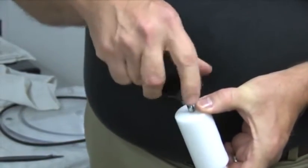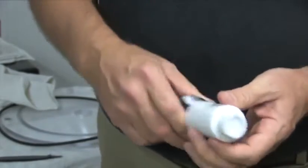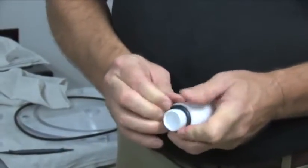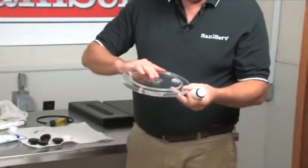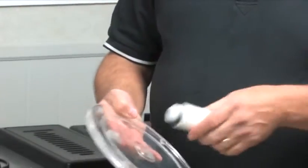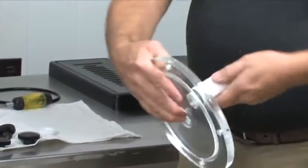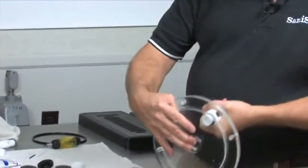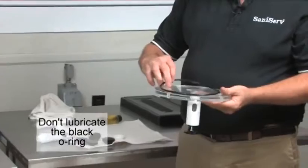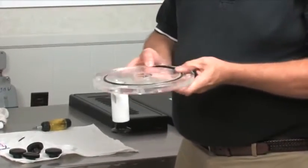We have the knob — it looks different than the other ones. Screw it all the way in and get it as tight as you can. Next goes the large fat O-ring that goes on over this for the seal. Then I'm going to grab the front plate, paying attention to where the recess is for its bushing that goes onto the dasher. Turn it to the opposite side and put the spigot on by screwing it until you find the thread or the place where it stops. Turn it just to where you have it straight down so it dispenses straight down. Next goes on the front plate O-ring that gets no lubricant — it's very important that this does not get lubricant; if it does, it will squirt out of the way and leak.